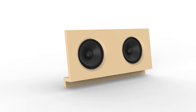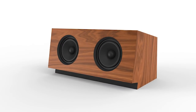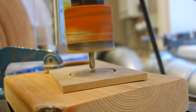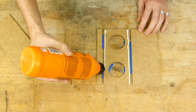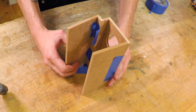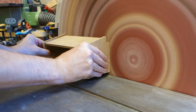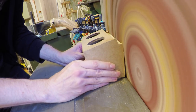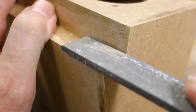I started out with 3D modeling a set of speakers using some 6mm MDF I had available. I built them rather simply, just cutting the pieces and gluing them together. It's not really difficult to get a box like this built. I ended up building the general shape of the speaker first, and once the glue dried, glued on oversized pieces on the ends, which I could trim down afterwards, rather than trying to make all pieces fit together properly from the start. If you have something to hold yourself to, it's oftentimes much easier to make, rather than to make all pieces exactly correct from the beginning.